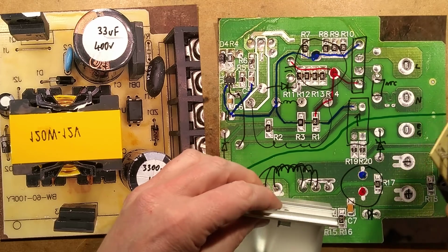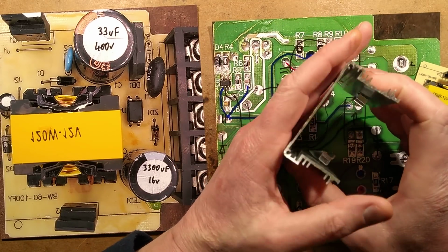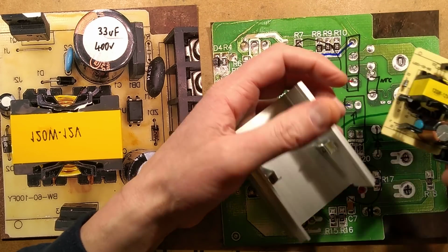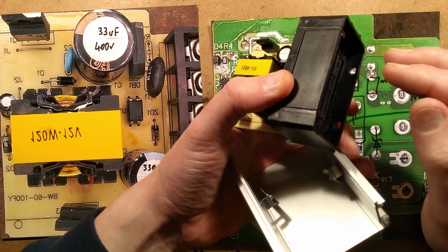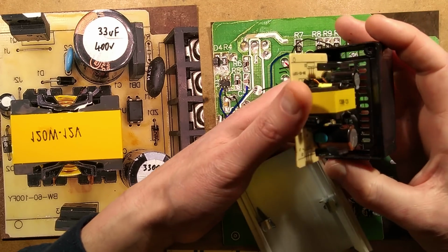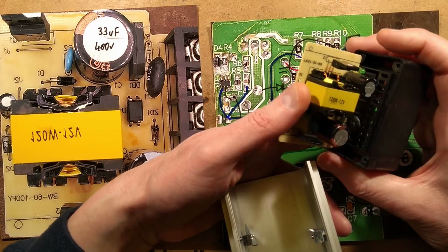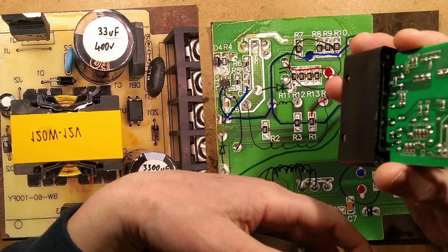It's interesting. The waterproofing is just not good enough, unfortunately. That's a shame. They could have gone that little bit further. They could have extended this plastic down and maybe put a couple of gland positions on it and then perforated it with lots of holes so that it would still have that draining facility, but it would limit the size of insects that could get into it. I suppose this is ultimately why most of the real waterproof power supplies tend to be potted completely in that sort of silicone goop.